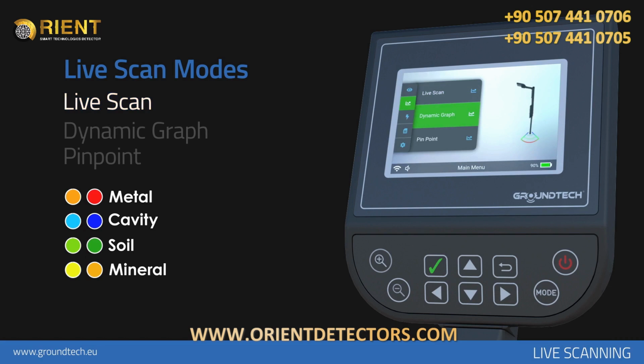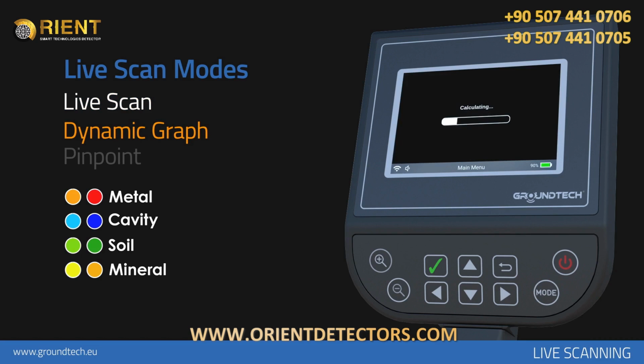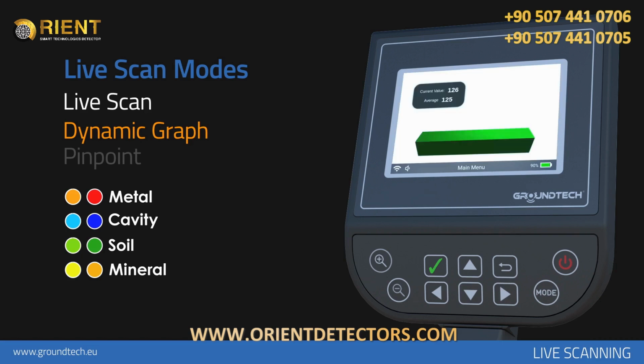With Dynamic Graph option, you can see objects with magnetic effect, metallic objects, grounds, and structures faster, like the live scanning option. In Dynamic Graph option, your device automatically detects the level of soil on your first scan and calculates your scanning according to this level. If you press the OK button on your device during scanning, the device will instantly update the soil level and you can carry on scanning with this new level of soil.